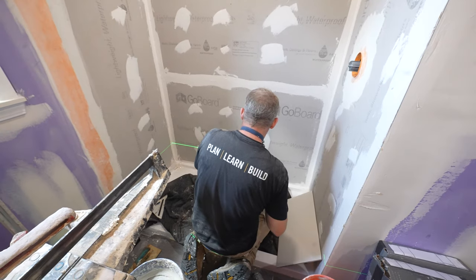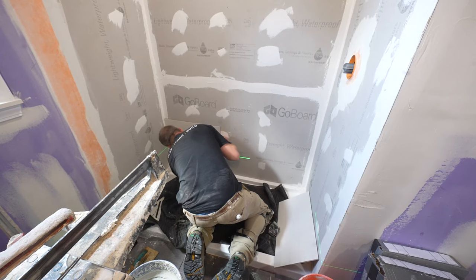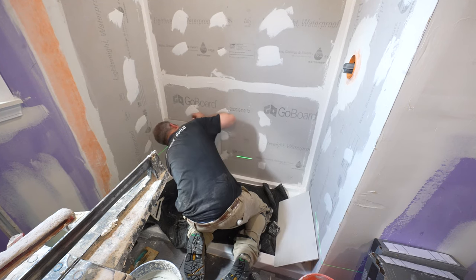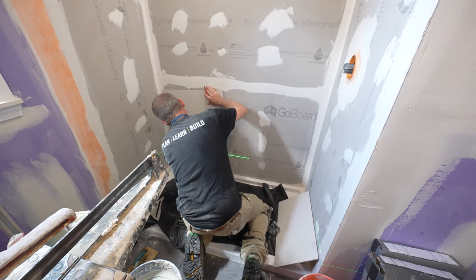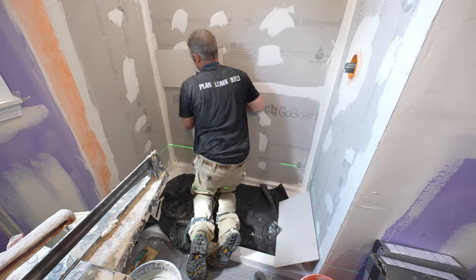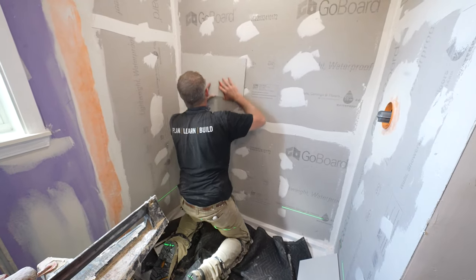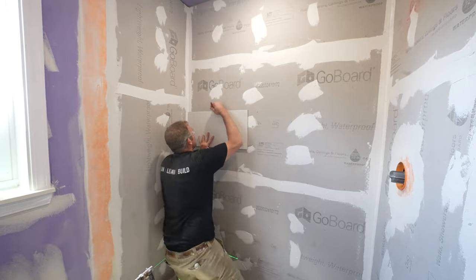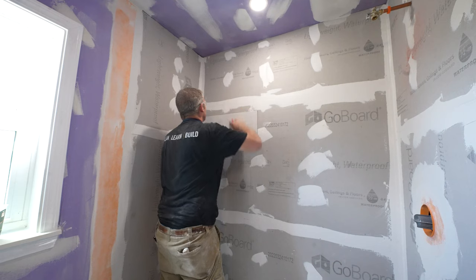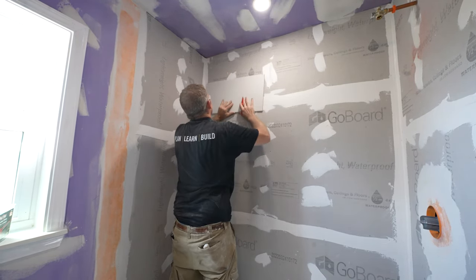Not a big deal. The only thing I also want to reference is my ceiling. So you can obviously measure this, or just set the tile on here and make some little indication marks on the wall to give you an idea of what it's going to be at the ceiling. I'm more of a visual person, so I kind of like just marking up the wall to evaluate this. Now you're obviously going to have some 16th inch grout joints here that'll extend it.